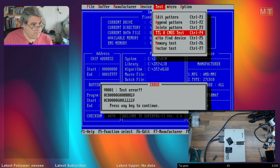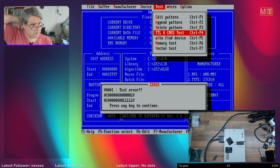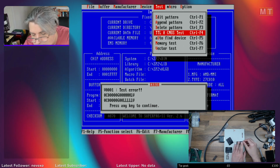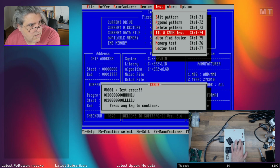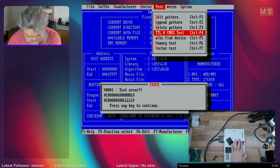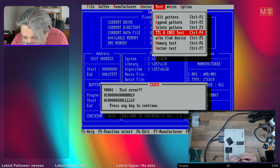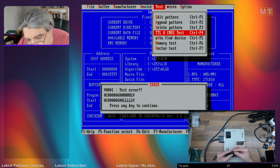So it's expecting to put a clock pulse on pin 2, drive most of the pins low, and see high on whichever pin numbers those ones are, apart from the last one, which is low. But it's seeing lows instead of highs. It might just be because the pins are short and it's not making good contact. Nope. Let's just wiggle it a bit. No, it's not happy at all, that one. So that one, I think, is dead. That's 74HC163. I'll throw that onto the side there as a dead chip. What's next?